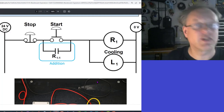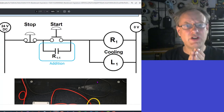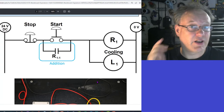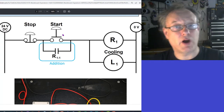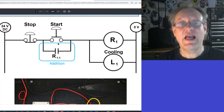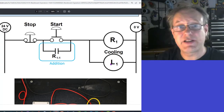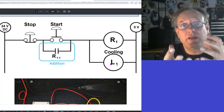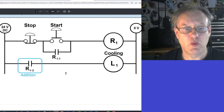There are lots of other ways that we can cool things. But essentially, just imagine that that is some device. Maybe it's just a fan. It's some device that when it is activated, it will cool something. Okay, good. In this case, I'm not going to walk through how a holding circuit works. I told you, you can go watch that PowerPoint. I press this button, I release it, and the cooling fan stays on even though my finger's off the button, because this memory latch or holding circuit is remembering the event of you pressing the button. Pretty cool.